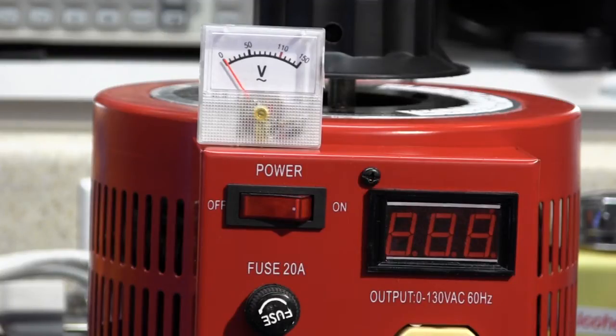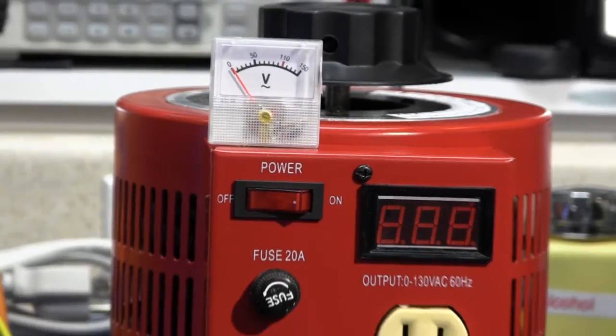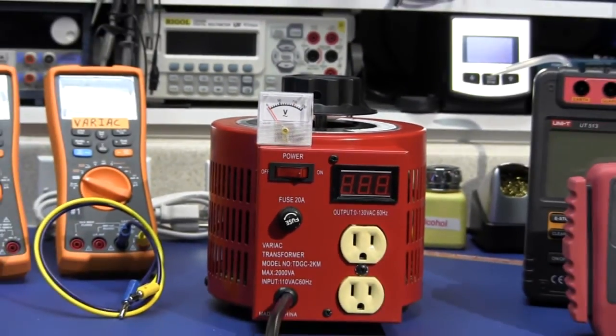I think this gadget cost me about $6 online for the digital unit. But upon installing the digital meter, when I opened the Variac up, I found that the ground wire was not connected to the chassis. Now this could lead to a dangerous condition if any part of the hot wire or the windings connected to the live connection were to make contact with the chassis.